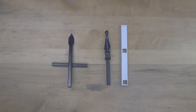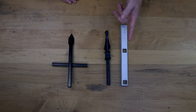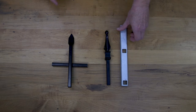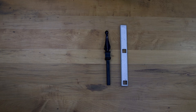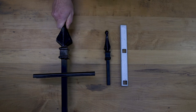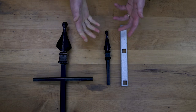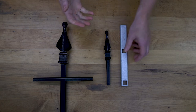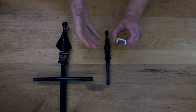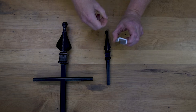At best, it's still going to start cracking the welds to the pickets at all the connection points. What we do is use a punched horizontal railing — we feed the picket through the punch in the rail and weld it from underneath. Our finished piece gives a uniform look on both sides of the fence and hides the welds underneath for a cleaner look. The shape of the railing also provides better strength and bend resiliency — it's a channel with a rounded edge, which is stronger than a hard 90-degree or knife edge. So that punched horizontal rail gives a cleaner look as well as stronger construction on your fence panels and gates.